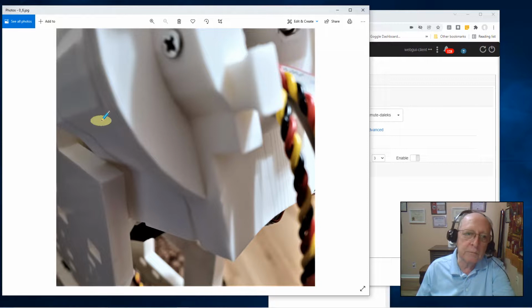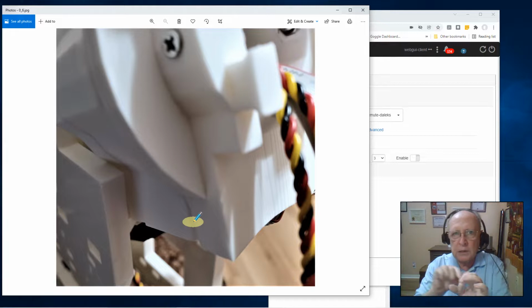This is the housing of the pivot assembly, and this is the plate that rotates. And here's where the two meet. What I did here, I used this edge right here as my zero alignment. I was showing you earlier the peninsula and the potentiometer plate and the hole. Well, you can't see all that during the electrical alignment, so I picked another point as a reference point. As we move forward, just remember this is the area I'm talking about.